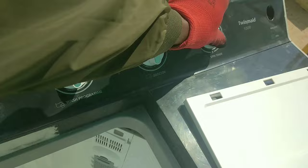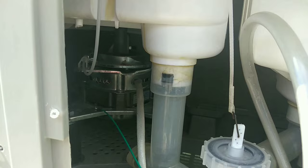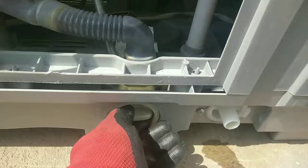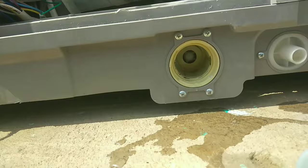I think this motor is good, as you can see. Finally I found where the sound is coming from — this motor is for rushing water out when you set your machine into a drain position. Let's check what's inside; it might be a coin or something sticking in there.